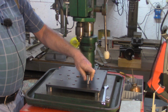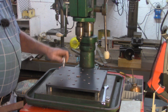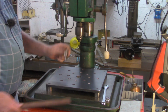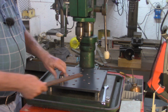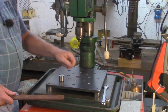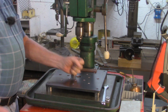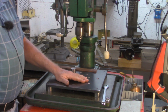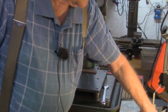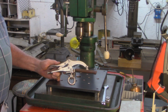We've got our new diagonal holes, and I've checked the fit on all of them. And again, what these are used for, put a piece in while you're drilling it, set the stop in, and that keeps it from twisting, like we know will happen and mess up a hand if you're not careful. But what about the augering up that several of you expressed concern about, of just having this? Well, there's this plain simple solution, a drill press clamp.